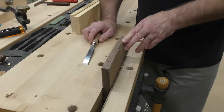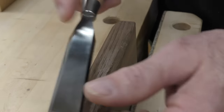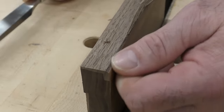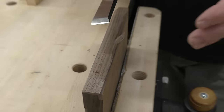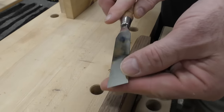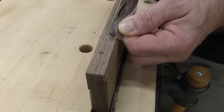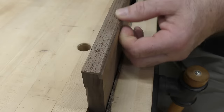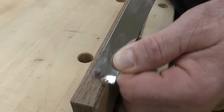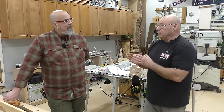Big D ran into a little dive — I call it a dive — because we were using it bevel up doing really light passes. I should have coached you a little better. When you encounter difficult wood grain, sometimes it's good to use it bevel down, and you will follow the grain less. But you still don't want to go at a high angle — just very light cuts.